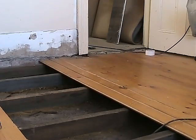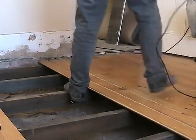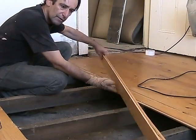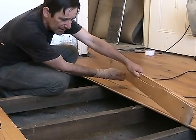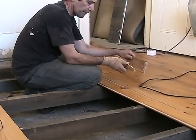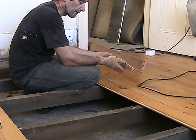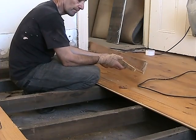I broke some of the tongue there — a bit too vigorous. So, without any special tools — although not many households have a pick these days — we now have a three-metre length of timber. I've been very vicious at the other end and it's badly split, quite brittle. But despite this we still have two-thirds of the length of tongue-and-groove timber that can be reused — we just cut off the split bit at the end. I'll admit we have to buy a few lengths to finish re-flooring the room.